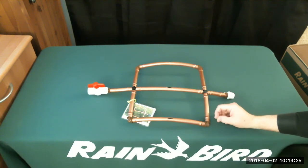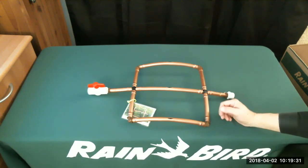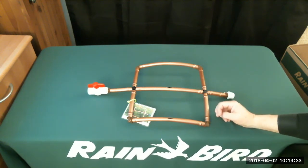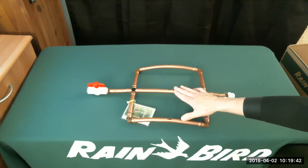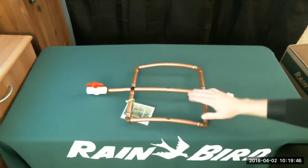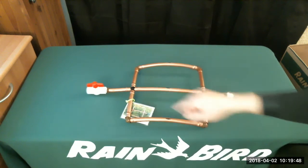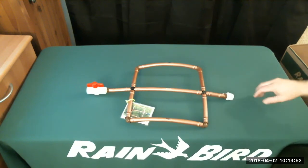You'll see those in the industry, and a lot will say, well, I want something automatic so it cleans all the time. It also wastes water, maybe up to half a gallon for every couple flushes. So every time you run your system, you're wasting water, and you do not need to flush this that often. It's mainly at the beginning when you're flushing your system, and then once or twice a year maximum to flush it, even with reclaimed water, because we have a filter that's going to be up front.